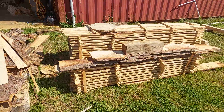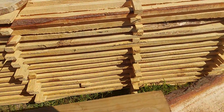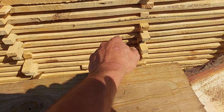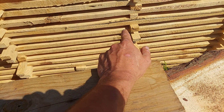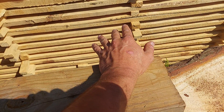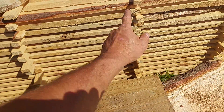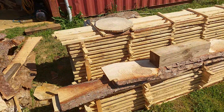I cut stuff that didn't matter if it had a little wave in it, just to practice. You can see right here there's about a quarter-inch cut. I stacked one directly on top of another because I thought if I had tried to put a spacer between them it would have bowed regardless — and you can tell it's got some definite bowing to it. A big part of that's my fault: I put these out without any spacers, so it sat there a little longer than I wanted.